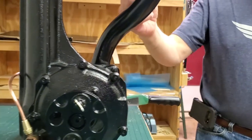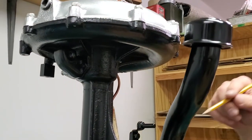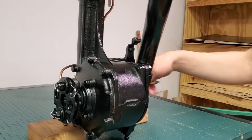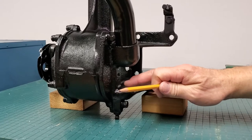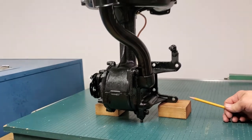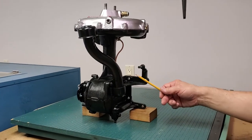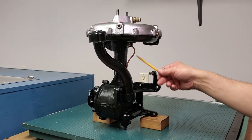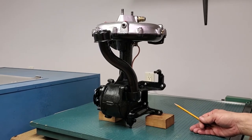The reason the oil tube is on the supercharger is because it guarantees that you fill the bottom of the supercharger with oil before filling the engine, since this also goes directly to the engine. The engineers made sure the supercharger was oiled on the bottom and top so that it would not instantly be worn out, because your vertical shaft runs in three different babbitted bearings. That was one of the things they did to make the superchargers work at a relatively modest price compared to other supercharged cars.